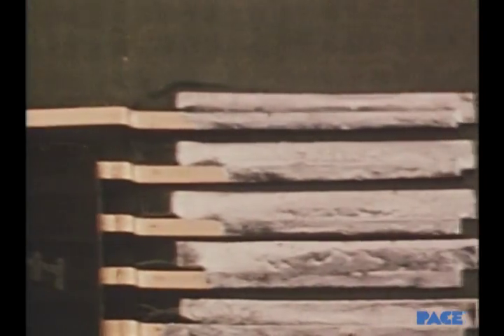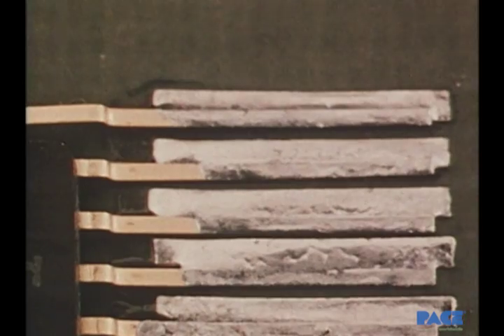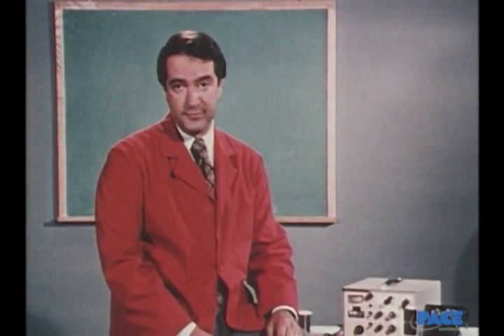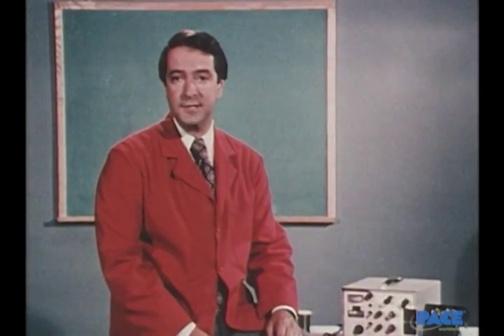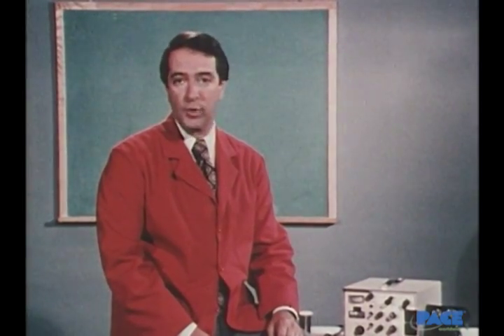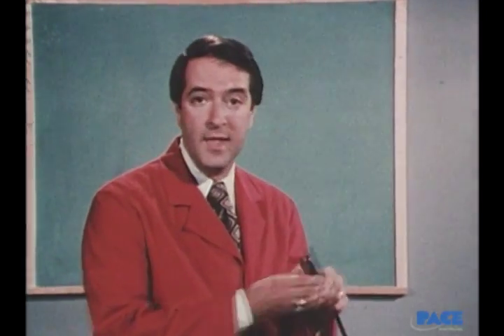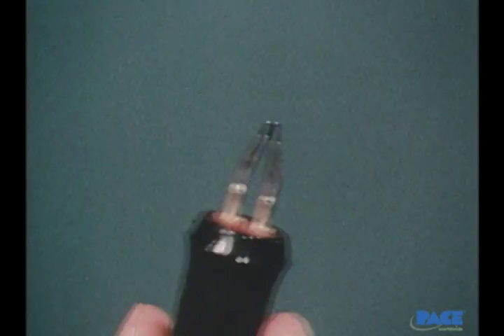Here are a number of unacceptable joints. The leads are not centered, and they overhang the edge of the pads. Doing reflow soldering like this takes considerable practice to do perfectly. It's difficult because there's no direct clamping of the lead during soldering, and the lead tends to roll up. However, you can easily solve the problem if you have a lap flow tool — designed especially to make this type of joint.